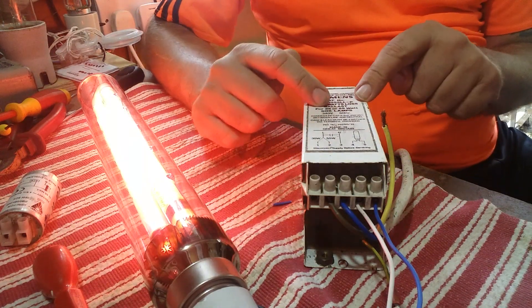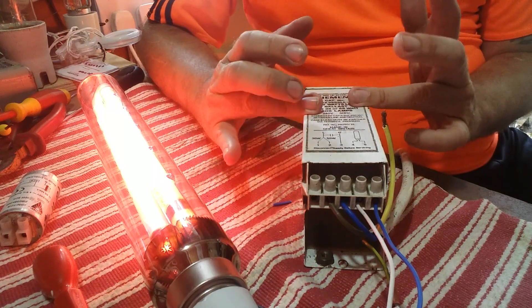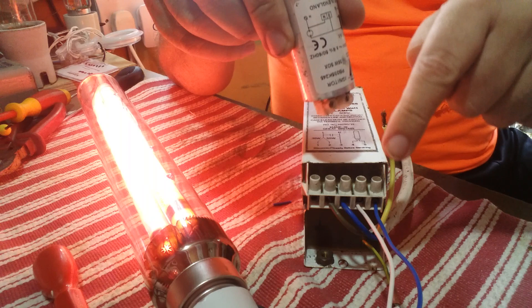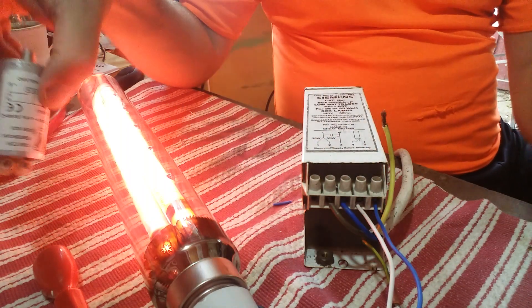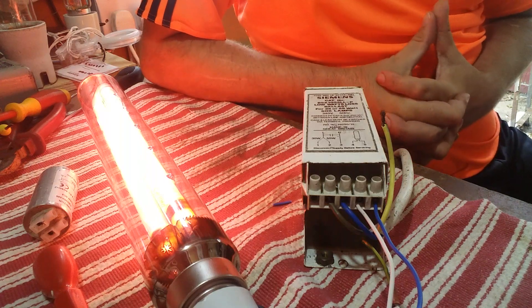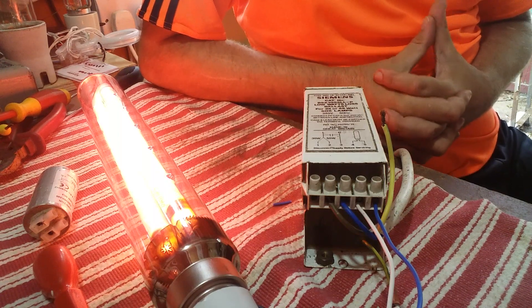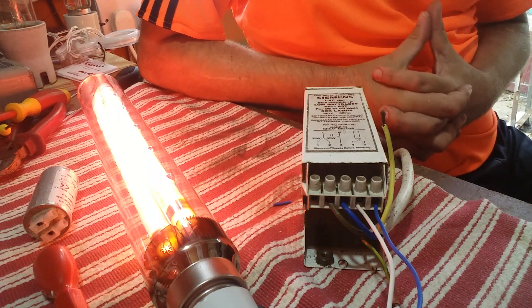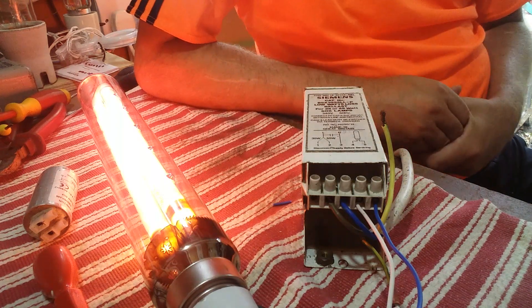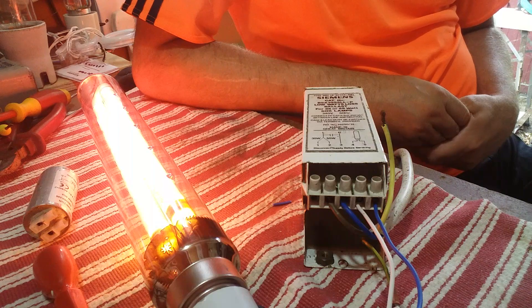This is just a little video to show you the difference between the two ballasts — they look the same but don't get caught out because they operate a little bit differently. We've also covered that if the igniters are shot on these, you can always put an external igniter looped in across the lamp terminals and it'll work. We've got another suggestion in the comments to do a three-part step-by-step restoration video of a lantern, which we'll be looking into — quite a good idea. Thanks for watching, give it a thumbs up, subscribe if you haven't yet, stay safe, keep the comments coming, see you on the next one.